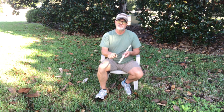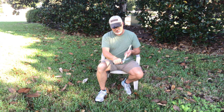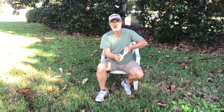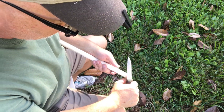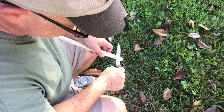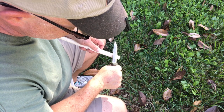Much like with the feather stick and most of our other carving skills, I don't want to hack away at the wood — I want to think of a slicing motion. Taking my time. I'm going to lay that blade flat, tip up until I feel the edge, and then just take a tiny little bit off. It helps if you angle the knife a little bit rather than coming straight in; if you angle a little bit, it helps with that slicing motion.